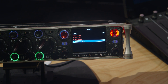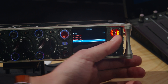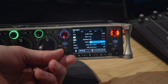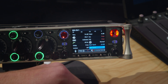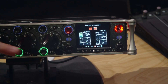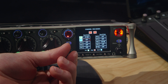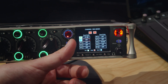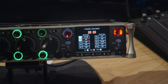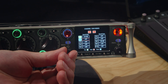I'd recommend keeping EQ post-fade so you always have an unaltered ISO track to depend on in post-production. There's also a phase selection, useful when running through unknown sources. Flipping the toggle takes you to the bus sends menu, where you can select which buses this channel routes to — either pre or post fade, or even as an unaltered bus send, which sends the channel to a bus program at a constant gain regardless of front panel activity.